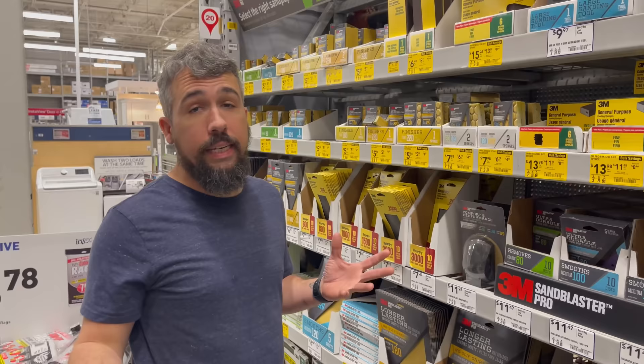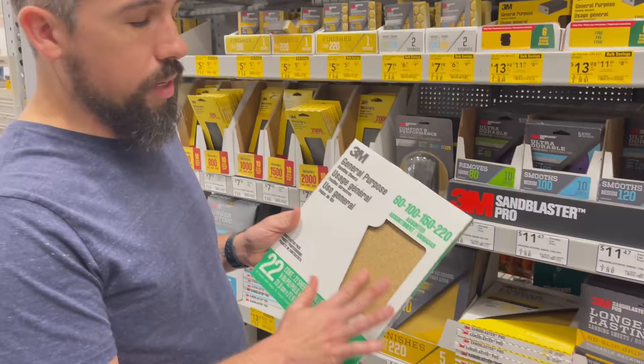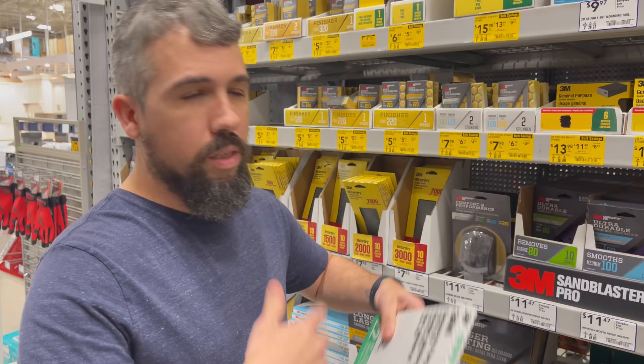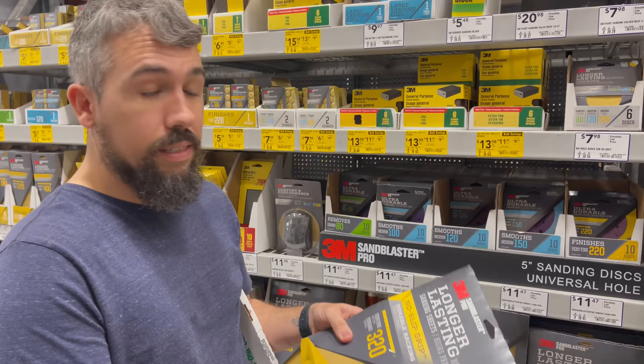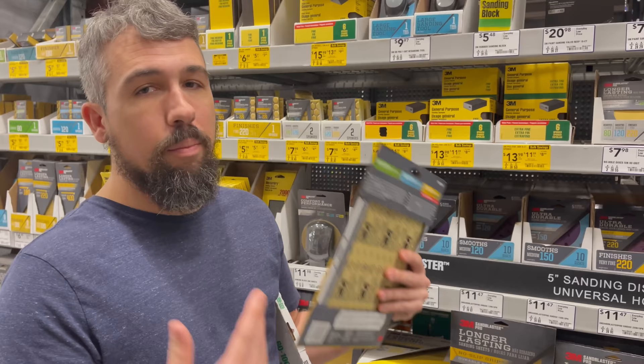First thing is sandpaper. A lot of people just getting started will come in here, look at sandpaper, and go, 'Holy cow, this is expensive,' and end up going with the cheaper general-purpose sandpaper. This stuff is absolutely crap. The granules come off, they're not consistent, and if it's 60 grit it might actually have an errant 50-grit piece inside it. What you want to do is buy the more expensive stuff. Buy it one time — it's going to last a lot longer, and more importantly it's very consistent and will yield a much better finish on your guitar, whether you're sanding wood or the actual finish. Don't cheap out. Get the good stuff.